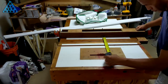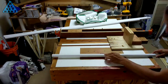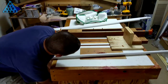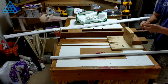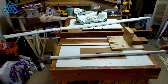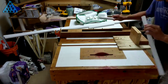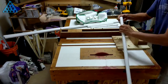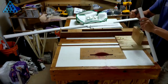PVC design problems are easy to fix, so if things don't work out as planned, it won't be too hard to make design adjustments. I've decided to make the footprint of my case a square for ease of construction. This allows me to set my table saw to 14 inches and cut all the PVC pipes to that one length. I also want to implement a sliding rail system for ease of case design — you'll see what I mean once I start constructing the case.